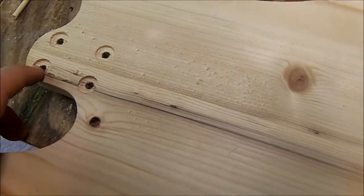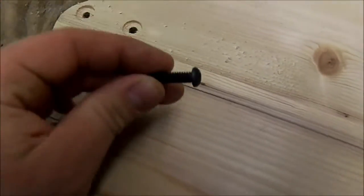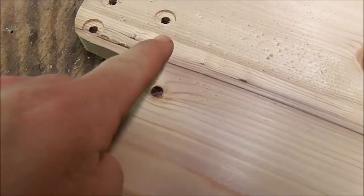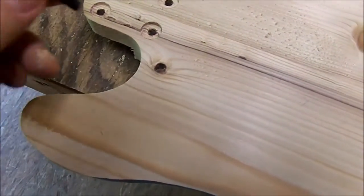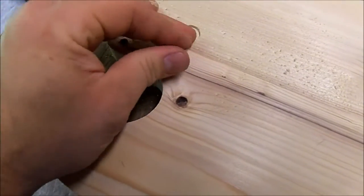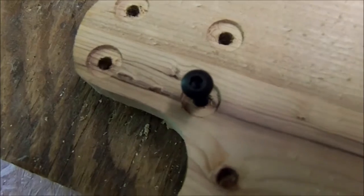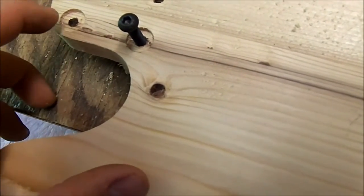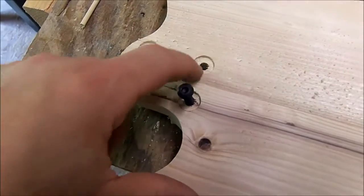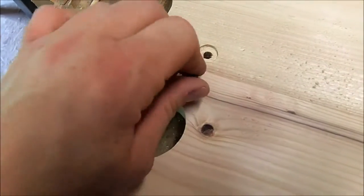The small holes are a quarter inch, and what I've been using is an allen head button head bolt - there'll be a washer that goes in first, I just don't have any right now, so the bolt will go in like that with the button head bolt. The only other thing that might happen is I may have to sink these four holes a little bit deeper so the top of the bolt head is flush with the back of the body.